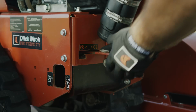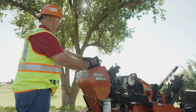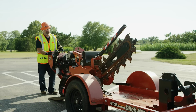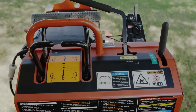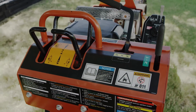Then disengage the park brake if equipped. Pull the boom control to raise the digging boom, but keep it as low as possible. With the engine at low idle, slowly back the unit down the ramps or bed. Before operating your unit, be familiar with the controls and proper operation of the machine.